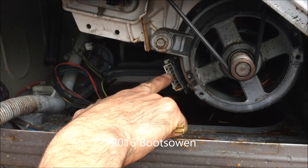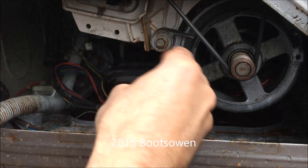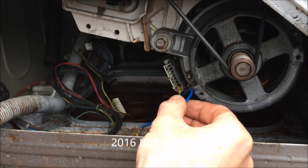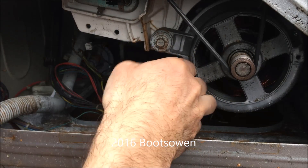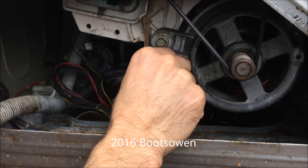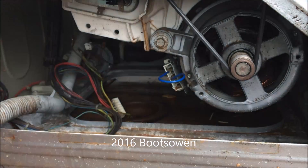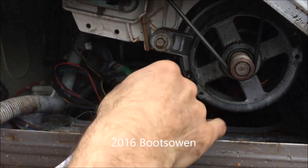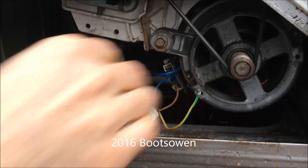We need power to go into a brush, from one brush to the other brush through the motor, then come out through a jumper cable into one of the windings and then back out again to the power supply. So we know the bottom two are not connected. I'm going to suggest that this fourth one from the bottom — center one — needs to be joined to its neighbor. I'm going to make a guess that the three windings are the top three, and that the two bottom ones are the brushes — that's not a guess, I know that. And that the one I'm plugging the live cable to is a brush, and the one I'm plugging this cable onto is a winding. I really don't know if that's true or not, but I'll just do it and see what happens.